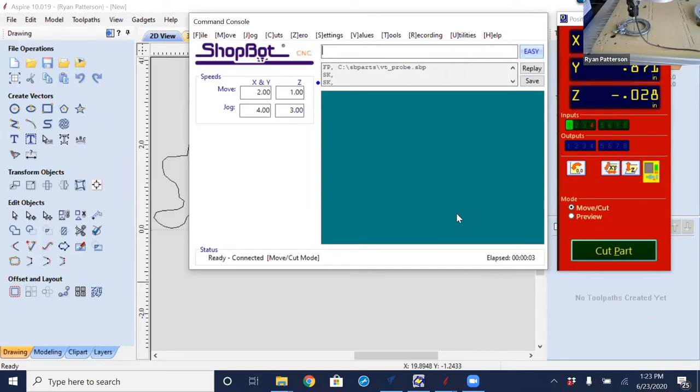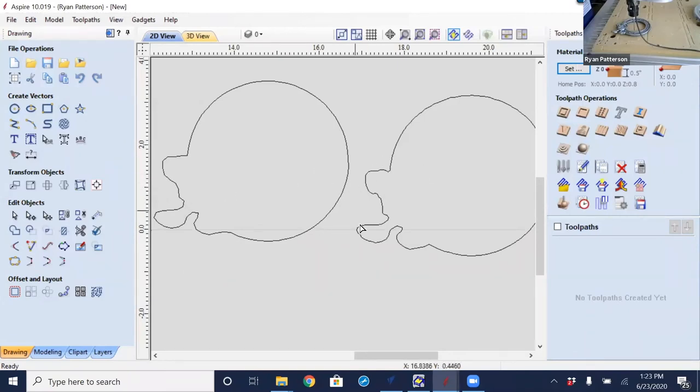So yes, instead of calculating all those points, really the only part of the shape that I probably care about is this outside edge here where Donald is sitting. So I might come in and node edit and remove all of these points here, and then just draw a circle in there and do a little node editing and use the scissor tool to trim some of that away. We're going to look at that this Thursday, and how to take these files and combine them all together in Toolpath. And even though we are combining now, we're going to go into a little bit more depth on how we could combine and also Toolpath all of this.